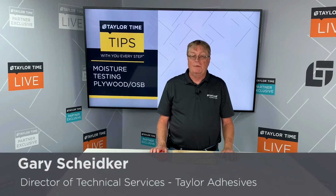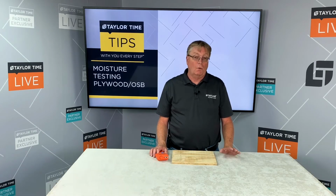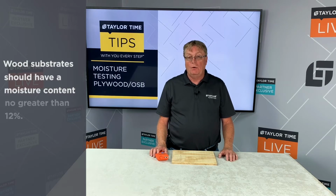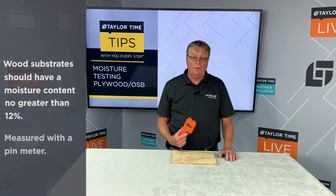Hi, I'm Gary with Taylor Adhesives, and today we're going to talk to you about moisture testing over plywood or wood substrates. Wood substrates should have a moisture content no greater than 12% measured with a pin meter.